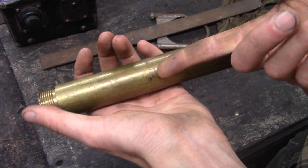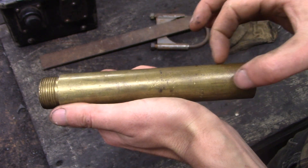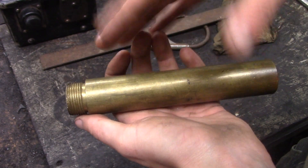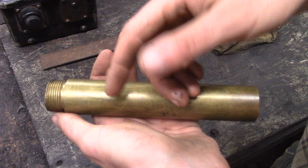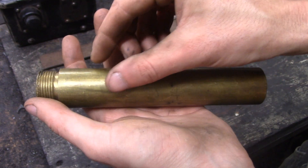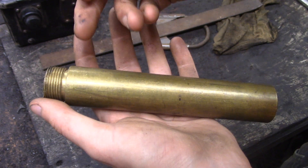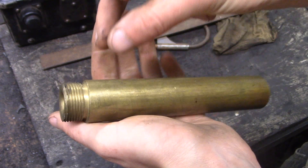The way it works: if you have a fluid going into a pipe of large diameter with a given velocity, as that flow is constant and choked down to the narrower part of the venturi — due to Bernoulli's law, Bernoulli's equation — as the cross-sectional area decreases, the velocity has to increase.